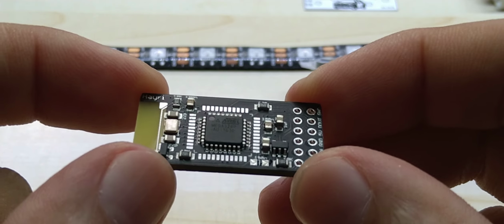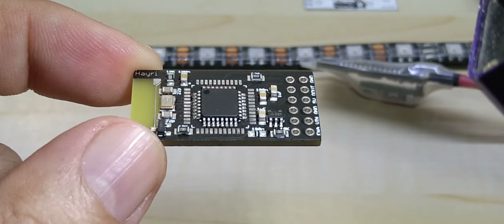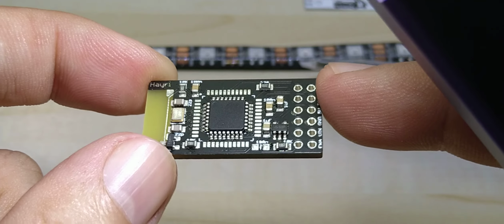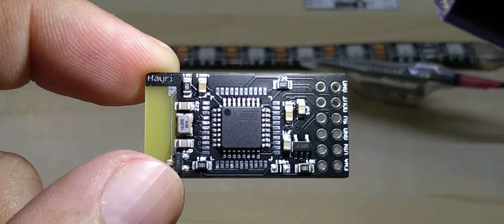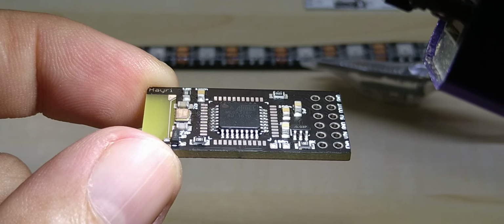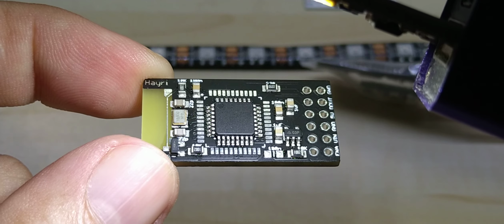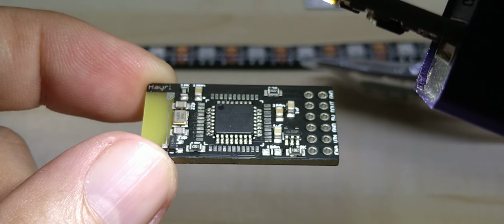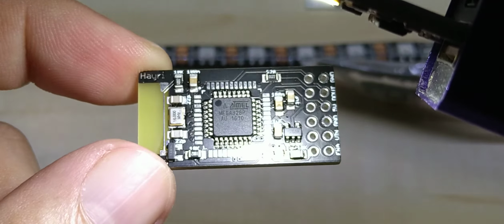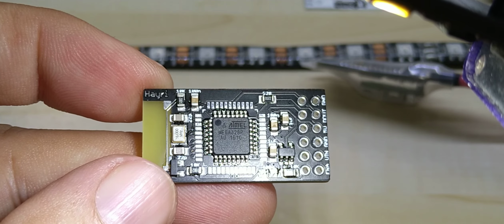So there you go. You can use a $3 mini hot plate to reflow SMD parts or take them off. It's actually for taking off, but as you see here, you can reflow with it and it works without a problem. The only thing I know is the professionals will complain about the heating curve being way too fast, but the parts can take it if you don't have really sensitive parts. And the 328 is one of the most robust chips that I have used.